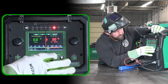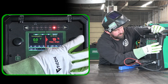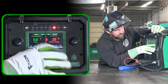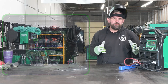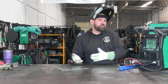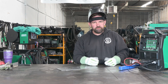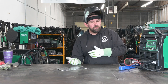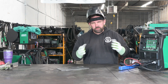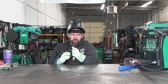So we're going to have 50% of the pulse at high amperage and 50% at our background amperage. Our pulse amps background is at 10 right now — let's kick that up to 25. This is typically what I would run for machine pulse, though I usually prefer foot pedal pulse. But if I am going to use machine pulse: 1.8 Hz, about 50/50 — sometimes 40% on-time with 20-25% background. This is my general preference for machine pulse.